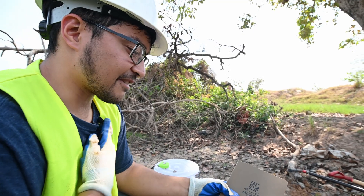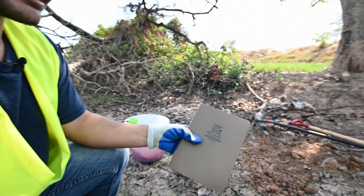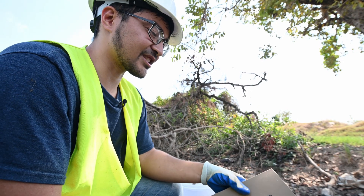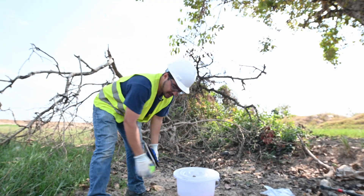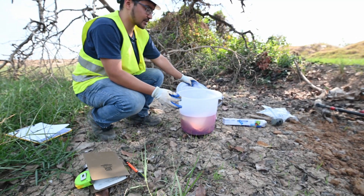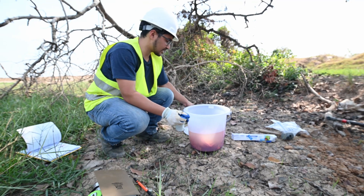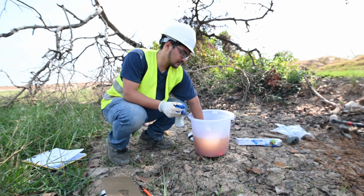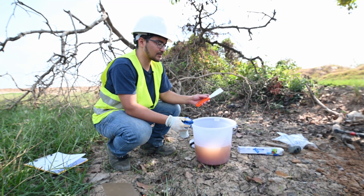The notebook itself is a product that writes in the rain, so all of it is waterproof. You don't necessarily need to have this sort of notebook, but if it does rain you won't lose your notes — so it's always good to prepare in advance for that. The last thing you'll need is a water bucket, which you'll use to clean your auger, your auger bucket, and your rods when you're finished. In this I have a large brush to scrub the clays, a rag or cloth, and a spatula as well. I use the spatula to scrape it off if it's extra tough.